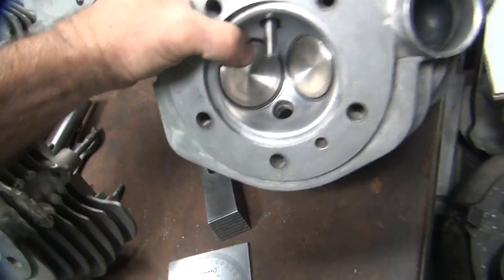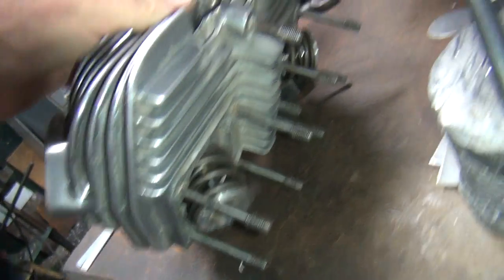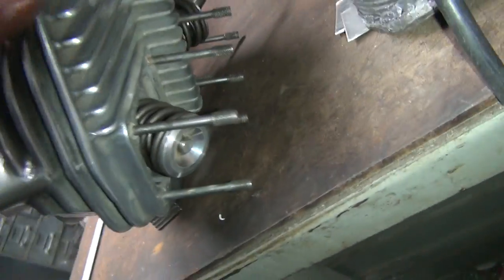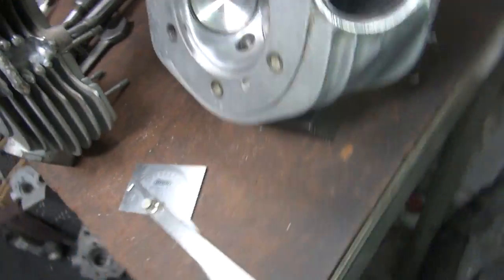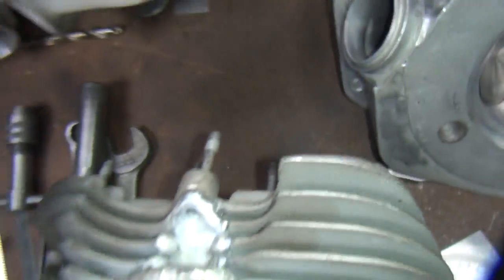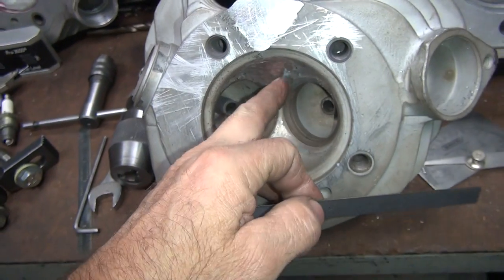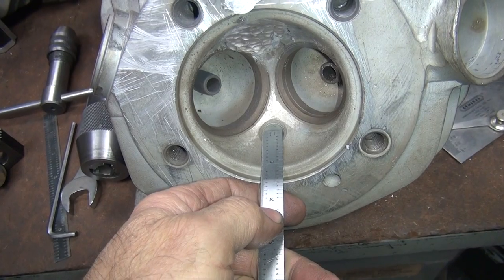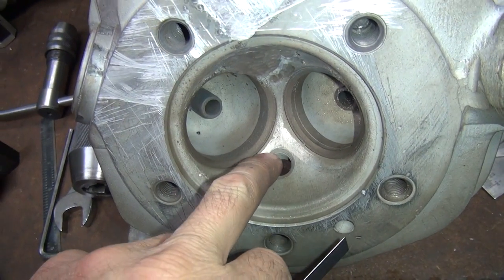The next problem is turning it the other way. Now we're sitting flat on these studs. You have to be flat here so I have to shim this up a little bit to make it actually flat. Make sure you're on the center studs — these two center studs. Both have a gap on them; they're equal on both sides. Then we look down the center of our stud and we look at where our combustion chamber angle is. We want our spark plug to go right down the center of the chamber, or most likely slightly toward the exhaust. Right now Harley puts them slightly toward the intake. When I do these heads, I actually center them up — I move them over about 100 thou, which slightly offsets them to the exhaust or right on center. It also makes the head thicker right through here so it won't break as much.